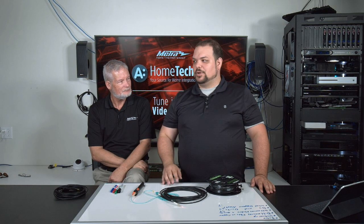And pardon me, I didn't do my research long enough, but I believe that this is multi-mode, not single mode fiber, so it doesn't go the full miles worth of distance of a single mode fiber. We don't need that residentially, even commercially. Exactly. So with this, you're going to get probably in the ballpark of 300 meters out of that? A little over, right? 1,000 feet, yes. That makes this a really nice setup for the future.